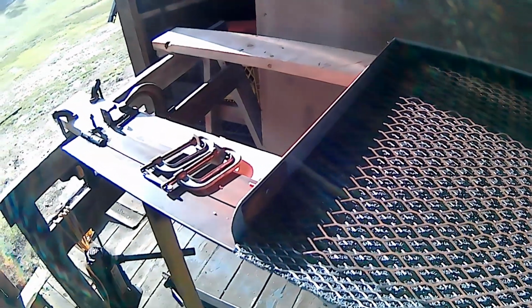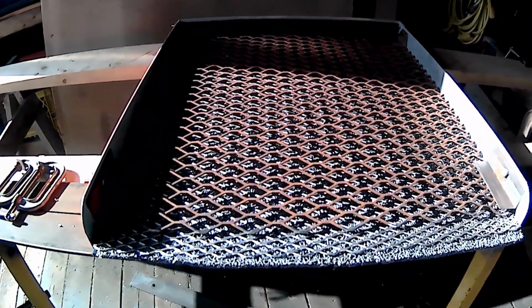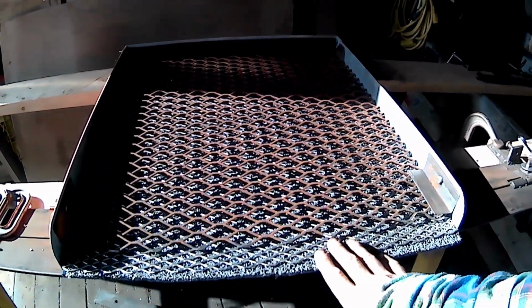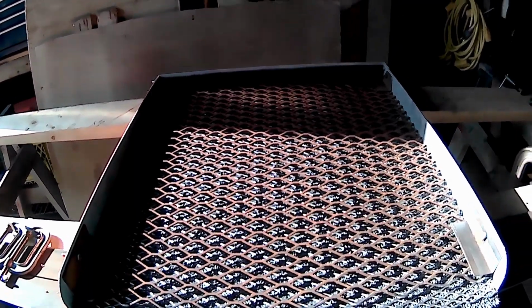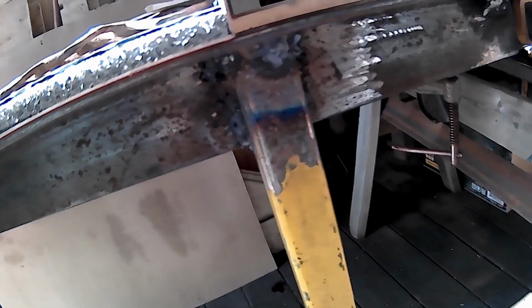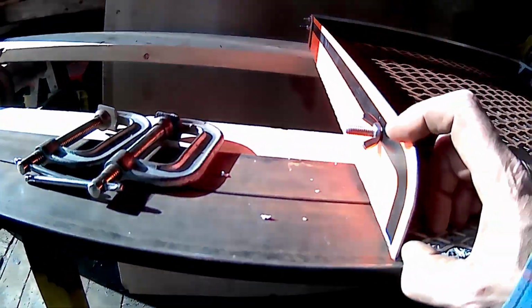But it's dinner time, and it was a good day. I got myself my contraption built that I always wanted to build for myself. And it turned out pretty good. Took me a little bit to figure it out, having to score the aluminum there with the saw. That helped. Get a little bit of extra metal out of the way and allow it to fold up, and worked out pretty good. As long as it didn't take too much out there and it doesn't break, that's my only worry. But for the most part, it looks like she's holding in there all right.